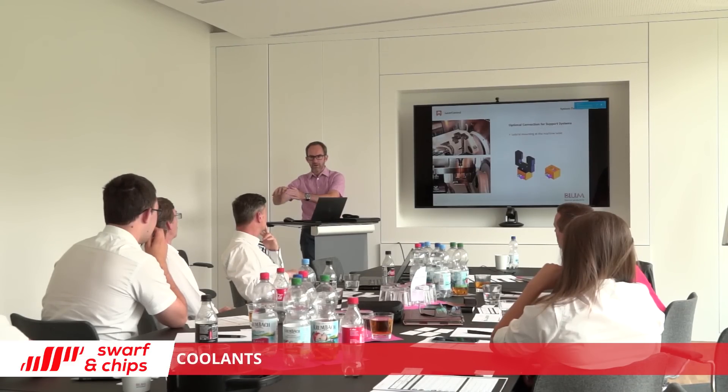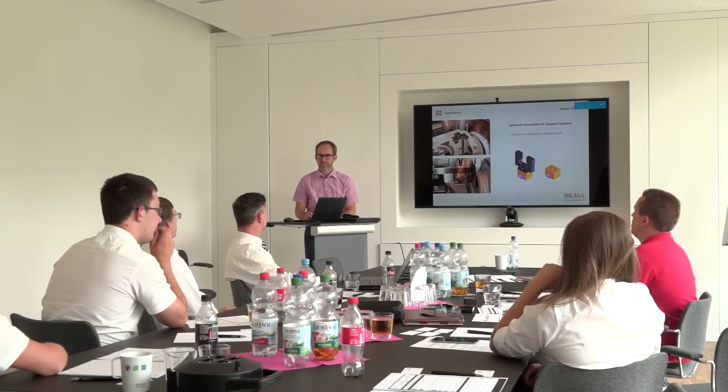We've just come out of a seminar and it was something like: productivity isn't parts produced, it's quality parts produced. A lot of customers will look at machine probing and say it's a machine tool - it's making money when it's cutting. I don't want to be measuring my parts here. We would argue if you're producing incorrect parts, you're losing out in a much bigger way. Yes, it's a machine tool and it's got to be cutting metal, but it's got to be cutting it correctly. We've got to know that when that part comes off, it's a good component - it can go to the next operation or go out the door as a finished component.